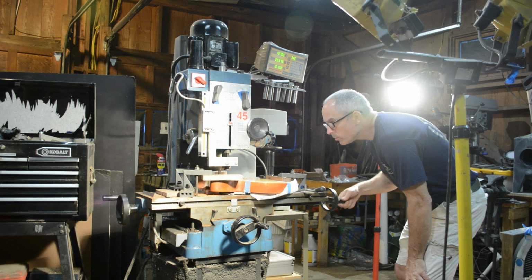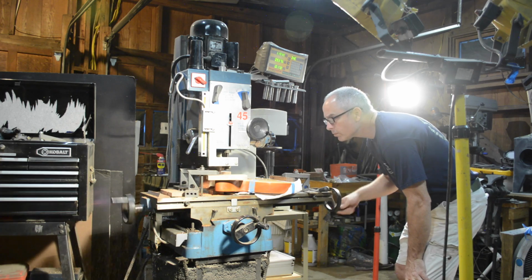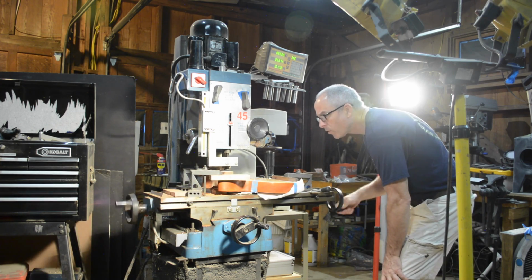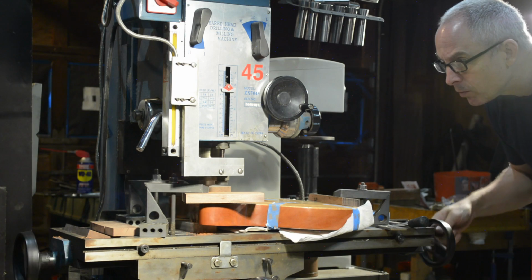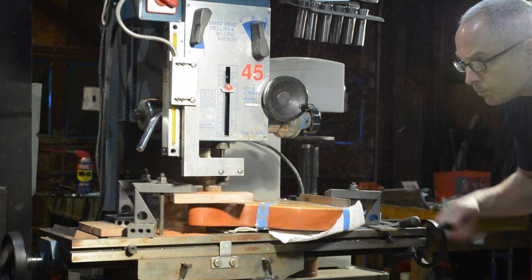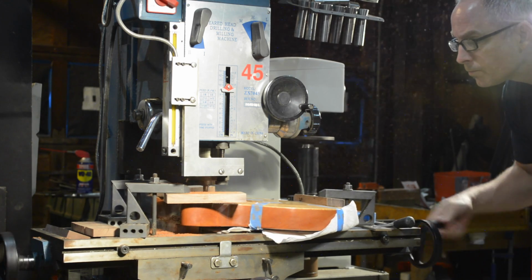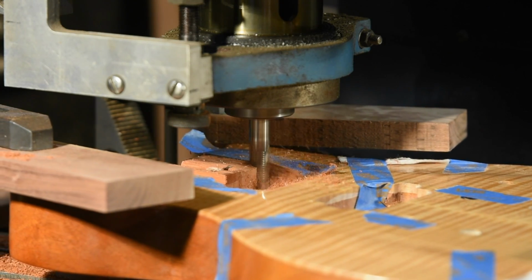Milling out the neck pocket using this 4-degree angle will in turn establish a 4-degree offset between the neck and the body. As with routing, the key thing that you'll see with all milling is the setup. Once you've made sure everything's flat and square, you can use the digital readout on the machine to cut everything to dimensions way more precise than woodwork demands.